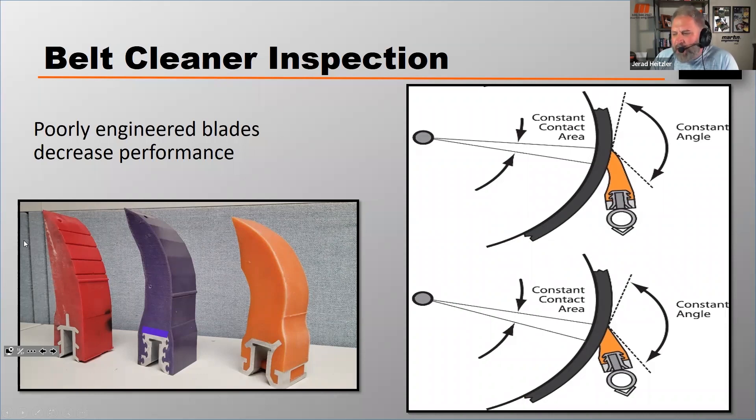This diagram on the right helps you understand why you should let the blade wear all the way down to the wear line. Well-engineered belt cleaners and blades are designed so you get full life out of the blade, which is why they have this unique curve. Typically, the more dramatic that curve is, the better the blade will wear over time. Most blades clean pretty well when brand new, but the key is to make sure the blade cleans well even at 75%, 80%, or 90% worn — and that's what the curve of the blade achieves.